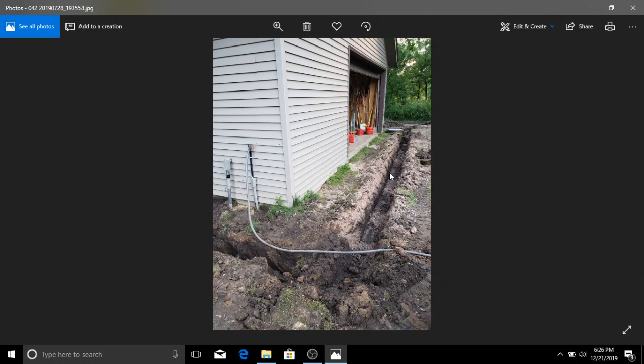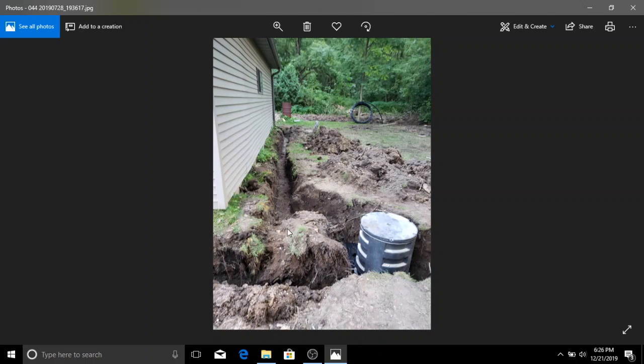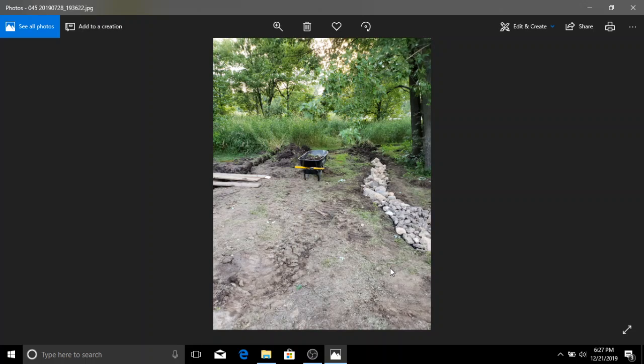Here's the French drain around the front of my garage — the 24-inch deep one. The excavator kind of makes a mess at corners, removing a lot more dirt than hand digging would have. But hand digging took forever, so I said screw it. That meant it took a lot more aggregate to fill the big voids. Here's the stump I had to go around — the pit was supposed to be right here, but the stump would not move. So the front French drain line comes here, the rear one comes here, and the downspouts go into solid pipe that comes in through here too.